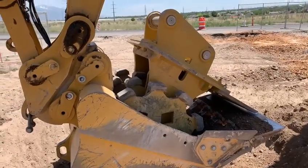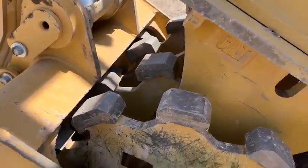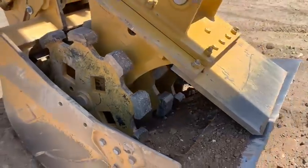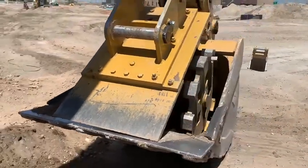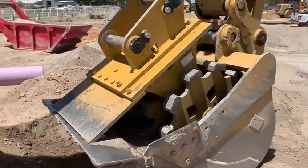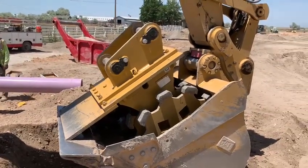This is how to correctly pick it up. This is the right way to carry a compaction wheel with a track hoe. You can see it's sitting in the bucket — there's no pressure on any of the wheels. It's secure, it's not going to fall out, and nothing's going to get bent.